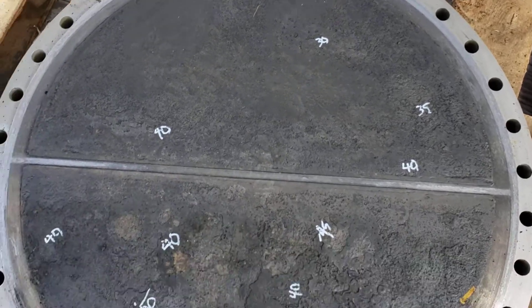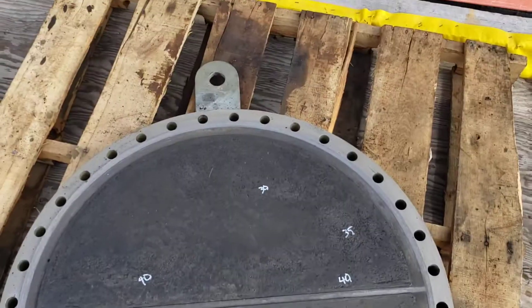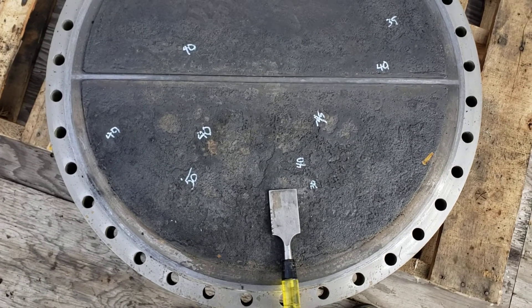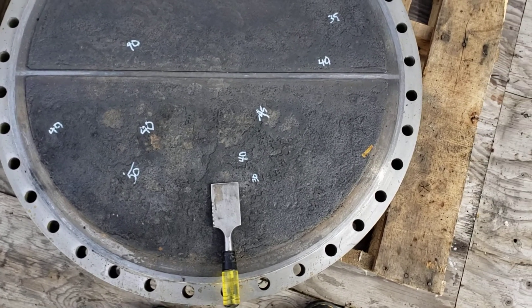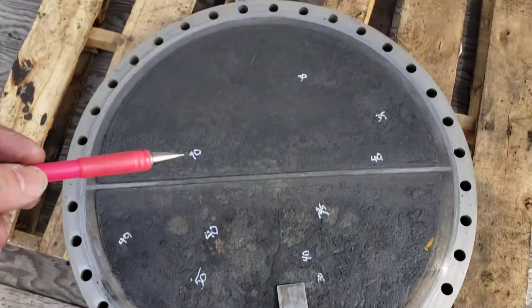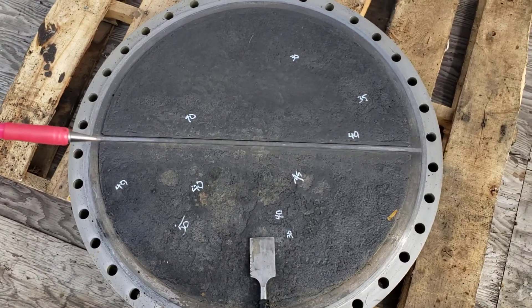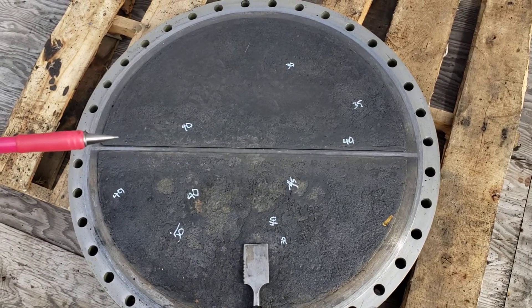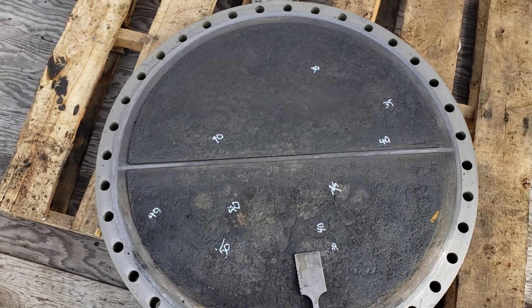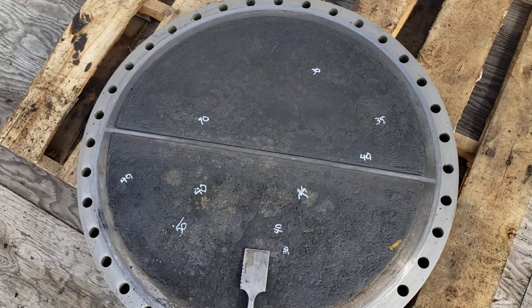Although it seems pretty well corroded and it is the entire surface — you can see the lifting lugs on the top so this is the bottom pass — I'm not sure if it's the inlet or outlet, but it doesn't matter because we're only interested in where it is relative to the original construction drawing. It's a single partition plate split, so it's a two-pass exchanger. This particular one happens to be an AES type; it has a floating head.